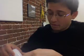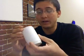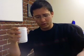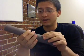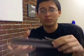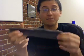We've discovered that the normal way for these pipe insulation splitters to fail or to start to not work so well is when the blade inside starts to get dull. And you'll know this if your split pipes start to have ragged edges. Anything like this is no good. Usually you can tell just by pulling the pipe insulation through, if it's at all difficult to pull, then usually you're tearing the insulation like this. So you'd want a nice smooth cut, but if you reach the point where smooth cut's not happening anymore from your blade, then you're going to want to swap out the blade.